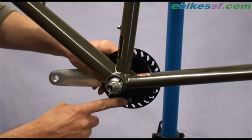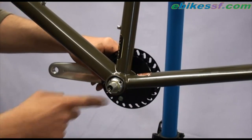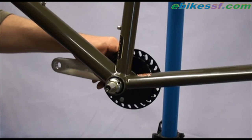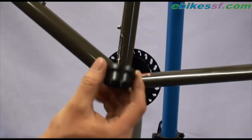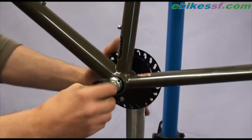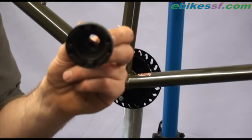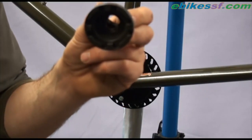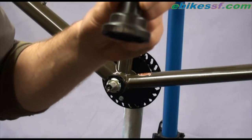Note the position of the white nylon screw, which covers the access hole for lubricant. This is the main nut. This is a special socket for tightening the nut. The suggested torque is 140 newton meters.